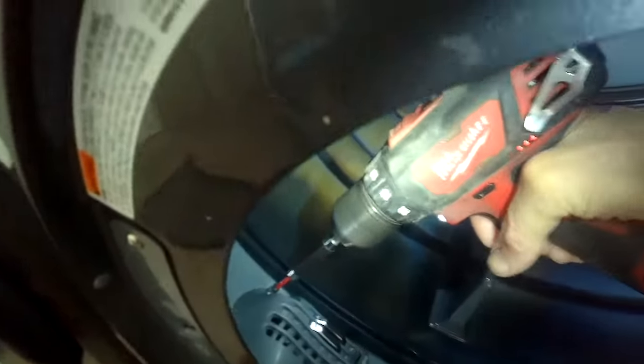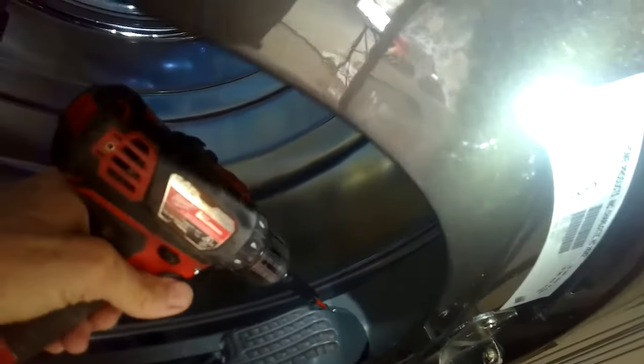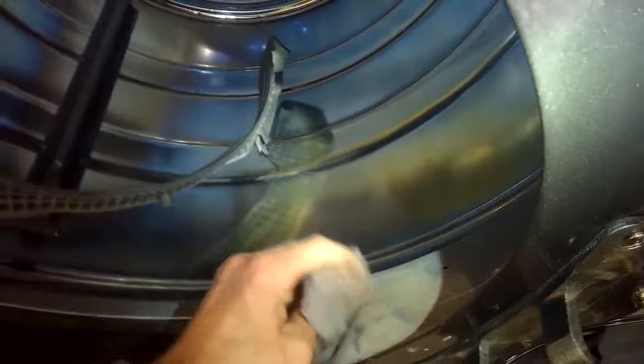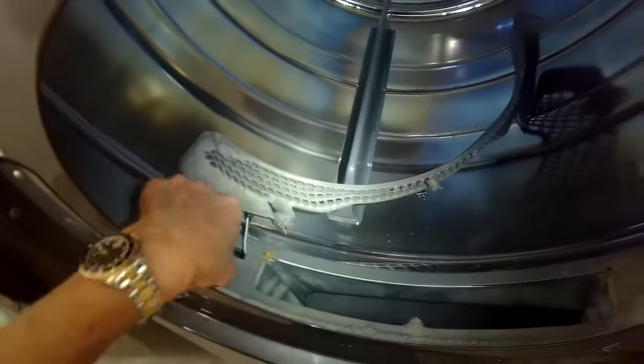There are also two little screws, and we're going to remove this filter housing — it's really easy to do. Two little ones on each side. Once we get the filter housing out, we'll have access to the blower wheel, though not very good access. Removing the front panel makes it easier but takes a long time, so this is a quicker way with less total work.